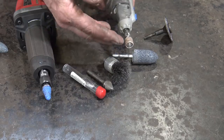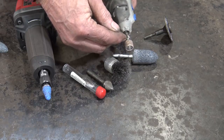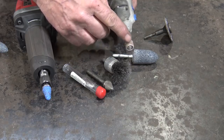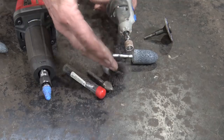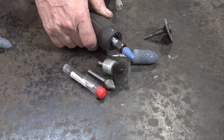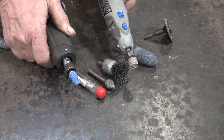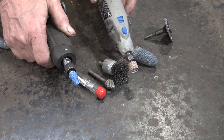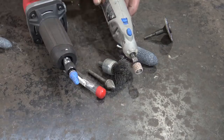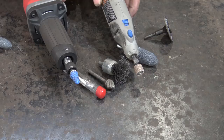That tells you a lot about how durable these are — they are small. This has a little sanding drum on it I've been using to sand the very top of some axe handles down, just to clean it up after cutting the wedge off. Very useful for that, but it is never going to do the kind of work a die grinder does. I would never think about using a Dremel for refining the inside of an axe or an adze. You would spend $50 in little sanding drums just trying to pull that off and you'd probably still be frustrated by the time the day was over.